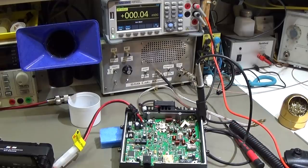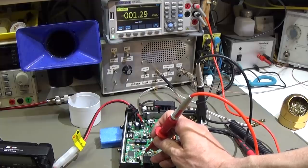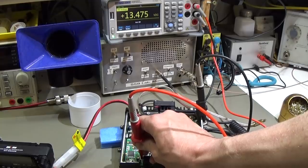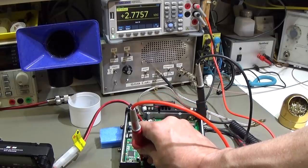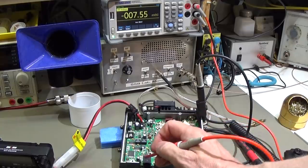All right, so let's see that we really can get that here on both the picture. And I go down here now to our R40, and let's see what we have down there. Aha! Have a look! Our 13.5 volt are really present at one end of our resistor, and it should be as well on the other side of the resistor. Let's see. Wow! On the other side we have 2.7 volt, and we should see more or less the same voltage as we have here.